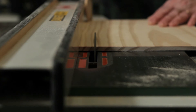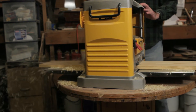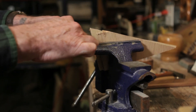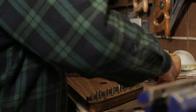It's a very good tonal wood with beautiful grain and it takes stain very well. After deciding the angles for the frames, for the soundboard on the front and the backboard, that's all from solid wood that I plane here on site myself instead of purchasing elsewhere — that keeps the cost down to the consumer. The bridges are handcarved by me; I use typically cherry, maple, and walnut for the bridges. Mapping out where the hitch pins and tuning pins go is a very exact process — I have to map out a grid with precise measurements so the notes will line up with the music wire, the strings. Then I string the instrument up with a musical wire like piano wire.